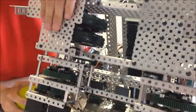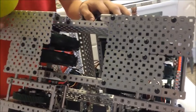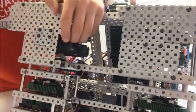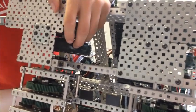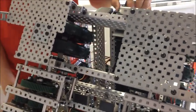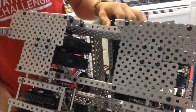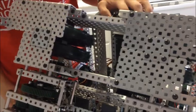We've also added shields on top — those help protect our wheels from any returning balls if they bounce back to us. We also decided to use the 5-inch wheels. We were running into a lot of problems with smaller wheels trying to save space, but eventually we just decided to try the 5-inch wheels, and that solved all of our problems. So if you guys are having problems with distance and you're not using the 5-inch wheels, I would suggest using them. They help so much more momentum-wise, because the momentum is really what's going to throw your ball.